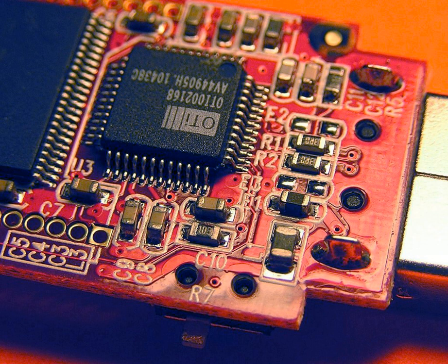Integrated circuits. Generally, integrated circuit packages are large enough to be imprinted with the complete part number, which includes the manufacturer's specific prefix, or a significant segment of the part number and the manufacturer's name or logo. Examples of manufacturer's specific prefixes: Philips HEF4066 or Motorola MC14066, a 4066 quad analog switch. Fujitsu Electric FA5502, a 5502 MB boost architecture power factor correction controller.